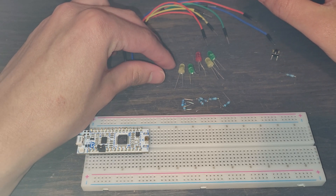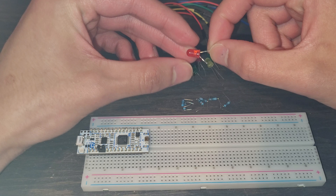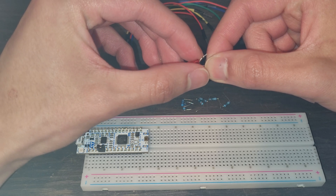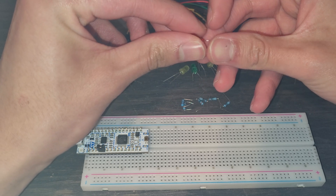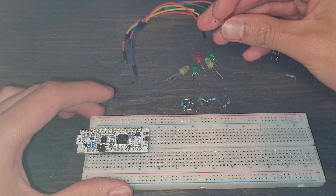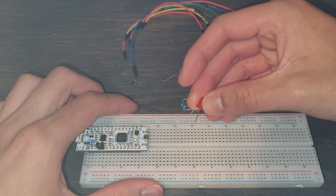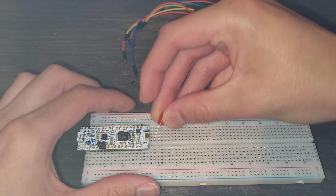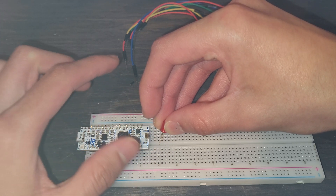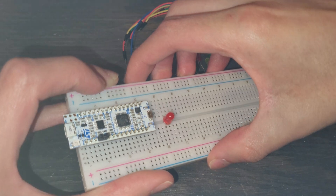We want all six of our LEDs. Current flows into the anode and out of the cathode. The anode is the longer side; the cathode is the shorter side, also indicated with a little notch so it's not fully circular. The top rail is going to be the ground rail, and we'll have a resistor that pulls it to ground. Current is going to flow into our LED, so we plug it into the breadboard going across the column.